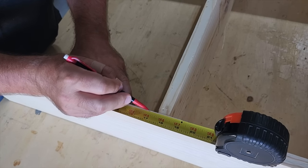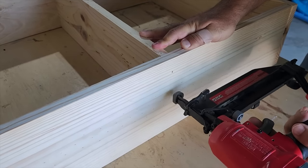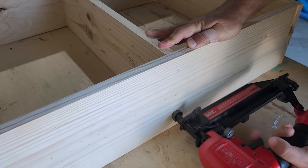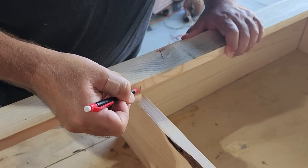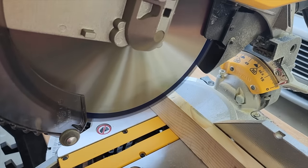I'm going to go 17 inches from the top. That's going to give me enough room to put some items on there and not worry about running out of room. I'm using the brad nailer to put this board in. Every shelf is going to need a little barrier to keep everything in.